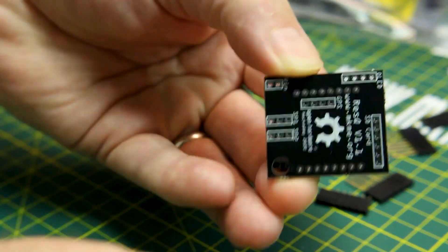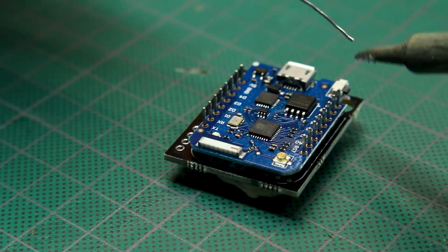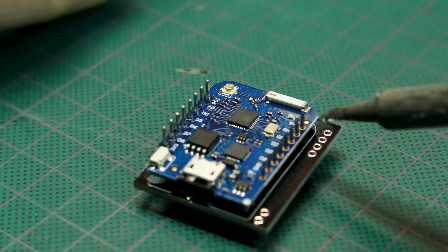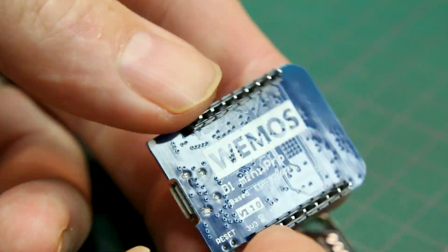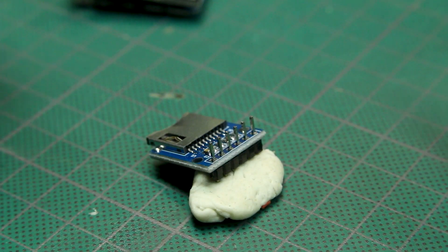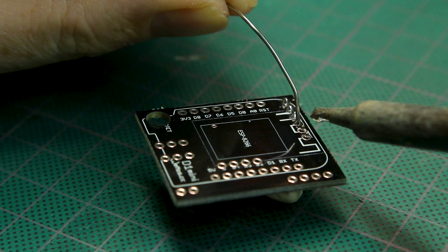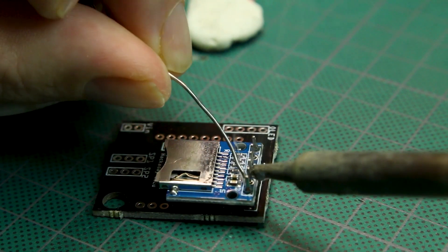I deliberately made this so I can stack them in multiple different ways, but we need to make sure everything is going to fit. Everything looks promising, so I go ahead and solder up the ESP8266 to the board directly in this case. You'll notice that I have the headers flipped around so the short side is closest to the board — that's to keep things really tight. Here's our micro SD card holder — this is SPI interface. I decided to use the headers here, but we can also use ribbon cable for this and the LCD or any of the components. Later on the ground unit I'll do this remote with a ribbon cable and attach it directly to the RESCU board as well — no issues.